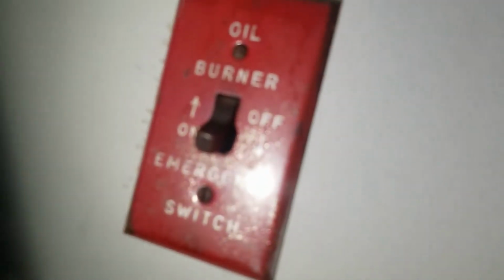So I'm shutting this thing off, okay? Off is down, on is up. So I shut this thing off. Last time I overloaded the other inverter because of this, so I make sure this doesn't happen. I'm going to turn the AC on. Let's double check what I have going on here. They're sharing the load. It's about 11 amps.